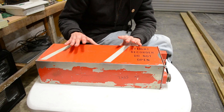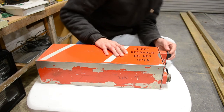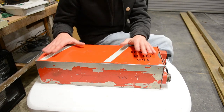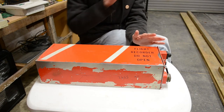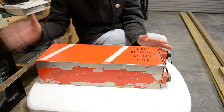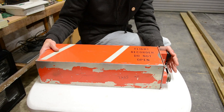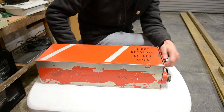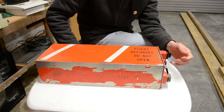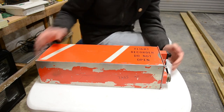Basically what I've learned is only from the ARINC 542A specification. Having read it a couple of times now to figure things out, it defines the plugs on the rear, the air ports on the front, or the other way around. I've yet to figure out front and back. Basically the pinouts, the signalling levels, how a plane talks to the black box.